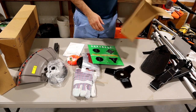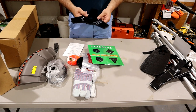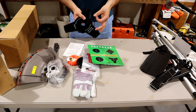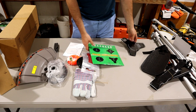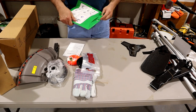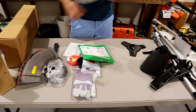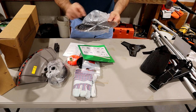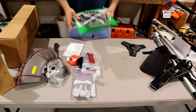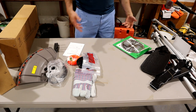We've got a tri-blade for your brush cutter. These work pretty well, actually, taking down small trees - maybe an inch and a half and smaller - really easy. Then you have a blade in here, and these are much better at taking down bigger trees, like three or four inches or less. You can use pretty much any saw blade on these things as long as it has the same hole. These work really well to cut down sapling trees.